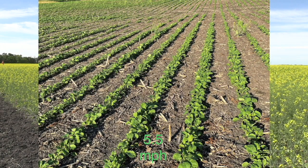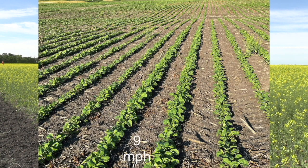Another factor was planter speed — how fast you were actually driving while planting. Did you notice a difference in emergence? We did not this year. The caveat is we planted on the 18th of June and it came out of the ground in three days with ample soil moisture and near-ideal conditions. It would be interesting to try this again in early May. We went up to nine miles an hour and did not see a difference in emergence. Most guys try to keep it five to seven miles an hour for more precise placement, as nine miles an hour makes it harder to get consistent depth.